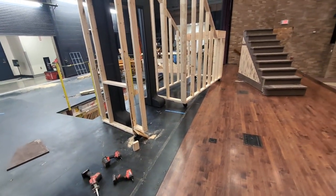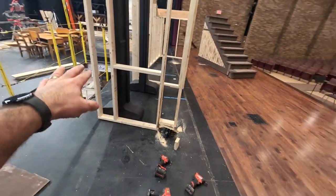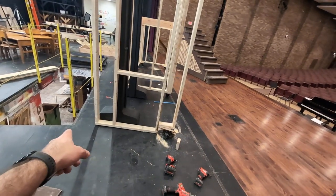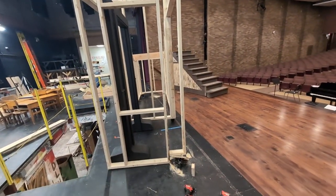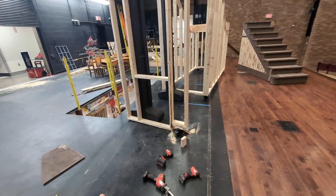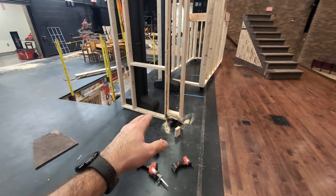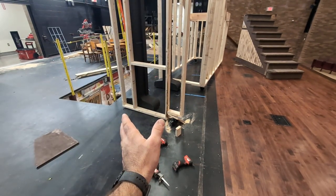We've shaken everything out. So, long story short, all those studs should be cut up that high. And now that I've cut the bottom plate, I can't reuse that. And once I cut them up that high, they didn't need to be made out of a 10-foot piece of lumber to start with. It could have been 8 feet. And so this is where we want to get a handle on it and stop the bleeding on productivity here. I'm going to finish cutting those and make a new plate and attach it to the bottom of there. And then we'll just hang the Luan down.